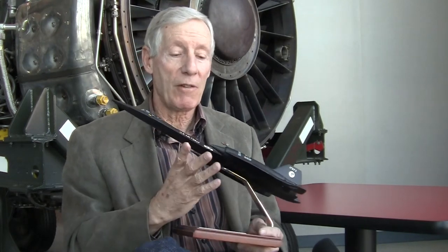The basic airplane is designed with two engines in it. The engine you see behind me is a J58 Pratt & Whitney, each putting out 34,000 pounds of static thrust at sea level standard day conditions. So you have a total of 68,000 pounds of thrust coming out of both engines.